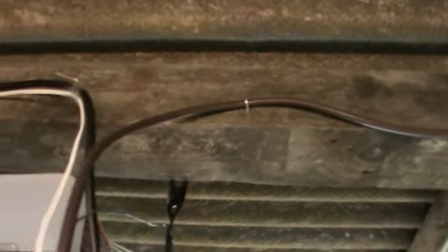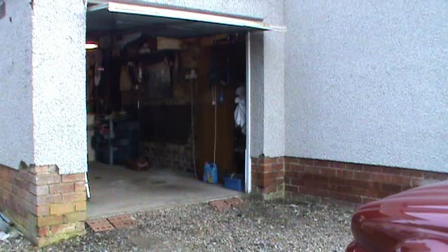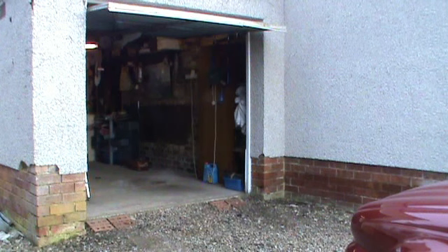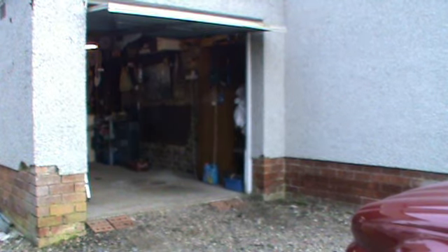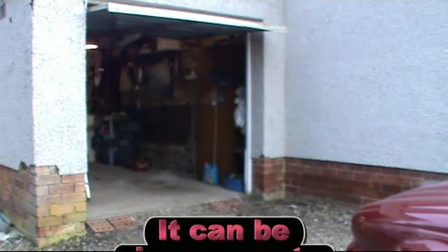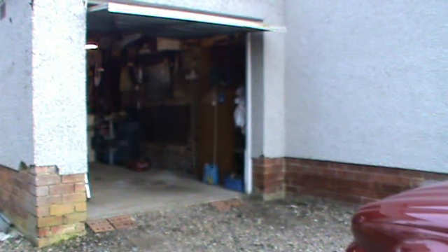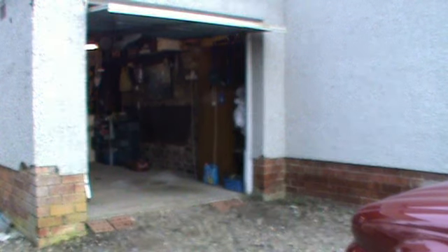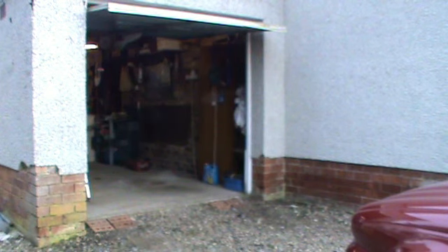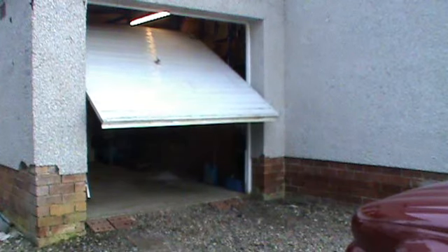That's the cable coming along inside the garage and coming down to the unit, plugging into the socket in the back of the power unit. Before, my coverage was only from the garden gate, and the difficulty there was that while you're coming around the corner your hands are quite full steering the car. This now allows me to open the door a couple of hundred feet before I reach the entry. I'll caution you here — it can be dangerous if you've got kids running about with a door opening where you can't see it, so be careful if you do fit this that no one is liable to be at the door. You can of course go and buy the proper antenna which is about £35, but this is quite a good deal for free. I think it's working just fine. Thanks for watching.